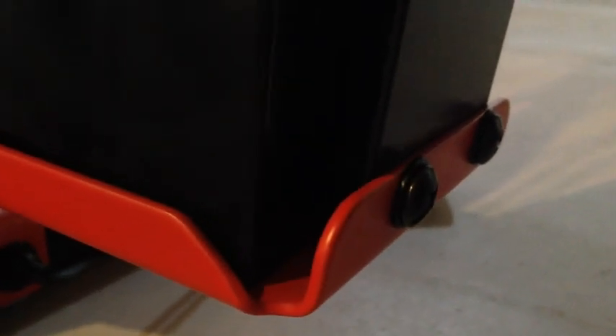The last issue that I ran into, and the most complicated, is how the rod box is attached to the unit. The black L-shaped metal piece that you see there has threads in it. However, the red part where the screws go through — there are no threads in that. Let's have a closer look. You have the screws and washers which go through the red part, which is part of the frame, and then screw into the L-shaped black metal piece which is threaded.